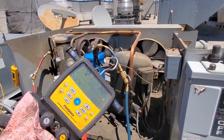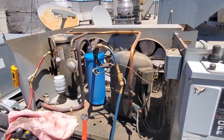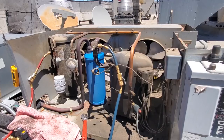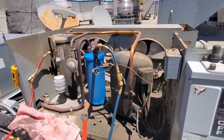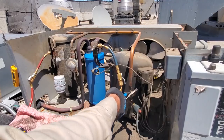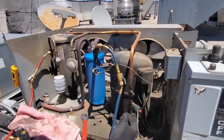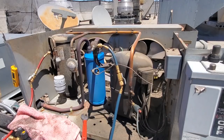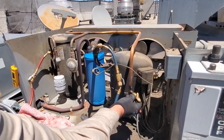If it rises too much I'll turn it back on, but seven PSI is pretty good. When it gets this hot outside, you've got to throw a towel or something over your gauges or you'll ruin the screen on them. All right — next thing, we're going to put in a dual pressure control. We're going to stop the high pressure port here, and utilize this port right here that's actually leaking and put a permanent cap on it. So I'll put the access T on it and then we'll be able to put the high pressure control on that. Should work perfect.